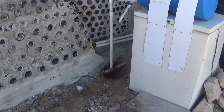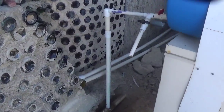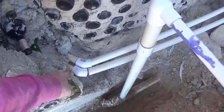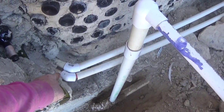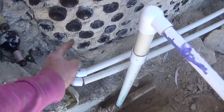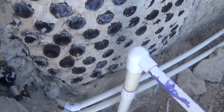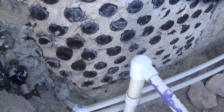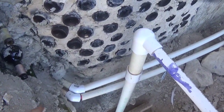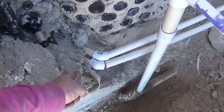Although this looked like a fairly simple wall, there's a bit of engineering that has to go into it, mainly because a lot of the plumbing comes right through here. What I've done is passed my three-quarter inch and my half-inch red PEX tubing through those pipes I showed you earlier. Red means hot, and that's exactly what it is. One goes from the two hot water tanks by the outdoor kitchen directly to the hot water tank that's going to be in the garage. There are going to be three hot water tanks — again, a separate video to explain why. The three-quarter inch PEX line is for this zone of the heating system.